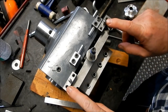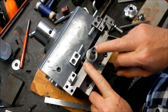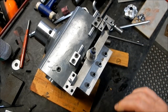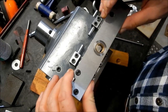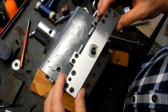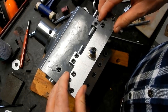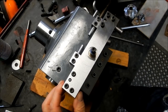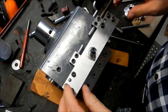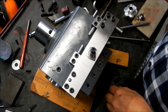Right, we'll assemble the bridge onto this. I've pre-fitted the screw in here because that needs to go in first. We've obviously put the nut back on, and we've trimmed the dowels back to length. And they're all in place, so we'll get this into place. This is going down through that screw bush. Precision fits. Oh, still not down there yet. There we go. Righto. Let's get that one nipped up now.